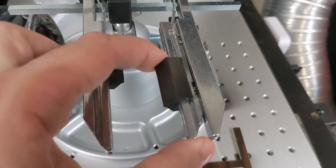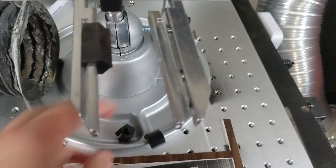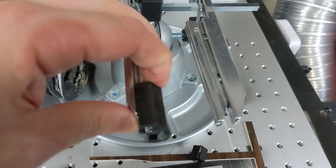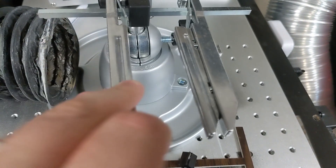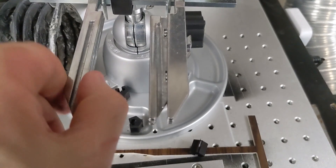The first one was the heating up — the warping and the melting. The rubber grips I used again in this episode are probably heat insulators according to some of the comments, and they're not allowing heat to escape the gold. If we simply took those off and grabbed it with the raw aluminum arms of the circuit board holder, that would probably do a much better job wicking away the heat. You could also experiment with different heat sinks and platforms to cut your gold on, but I think that simple change probably would have made a big difference.